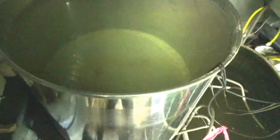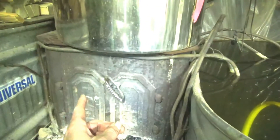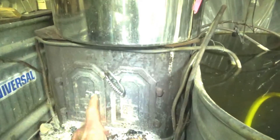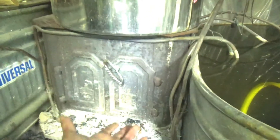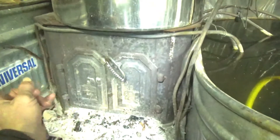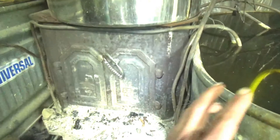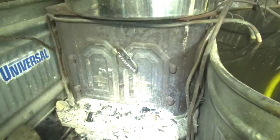So that's cold water settling in a pot of very hot water. That same process works over here on these coils. These coils are wrapped around the stove - they're copper - and they're set up so that as the water heats and expands it rises up the coil. Because it's heating, it forces flow in the coil, which draws cold water in, warms it, and it rises and gets pushed out.